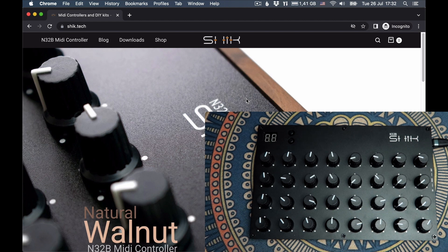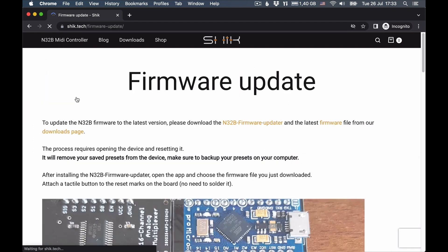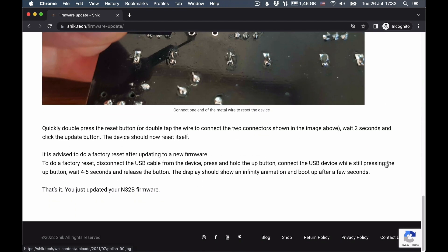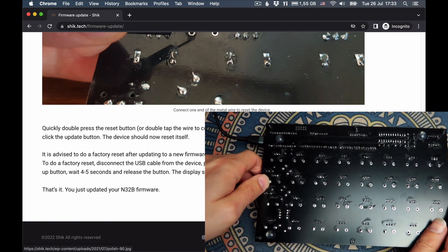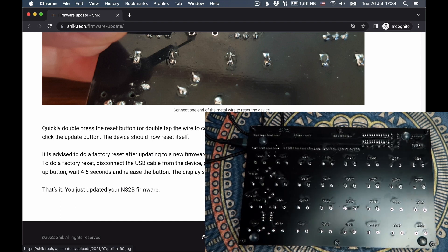When I was talking with Chicco from Schick, he told me that my firmware was probably outdated, so I could update the firmware to get the other features he made for the controller. Let's do that now. Although there's an Arduino Pro Micro inside, you're not going to program it with the Arduino IDE — Chicco made everything way easier so you can do it in the browser using his web editor. But first, we need to reset the Arduino Pro Micro by shorting these two pins, and that's exactly what I'm going to do.